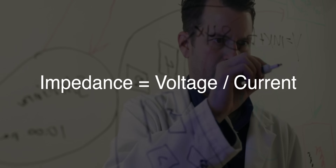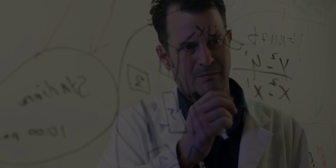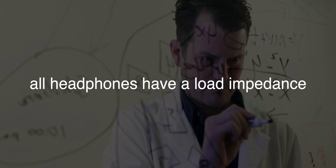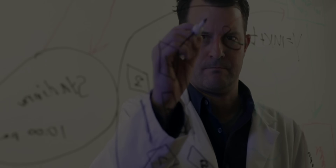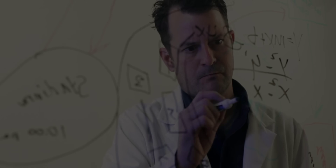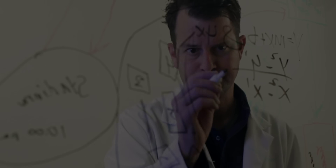This has an output impedance of 40 ohms — that's pretty high output impedance. You see people talking about how that affects the damping factor and how it will change a headphone's frequency response in cases. Impedance is a relationship of voltage and current. Current is the actual movement of electrons through a circuit, while voltage is what we usually think of when we talk about electricity. We usually don't have to think about current in headphones because most amplifiers supply a constant voltage, meaning when we look at the frequency response, we're looking at output for a given voltage. All headphones have a load impedance, which determines how much current is actually flowing at different frequencies. This starts to matter when our amplifier has a higher output impedance, because that limits the amount of current which can flow for a given voltage.